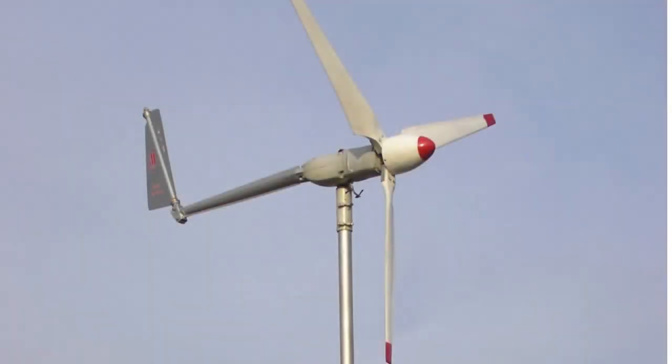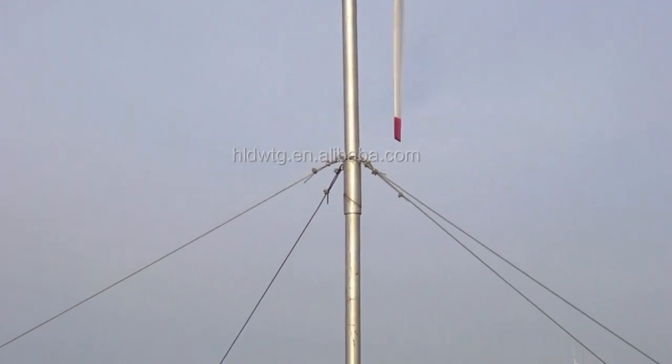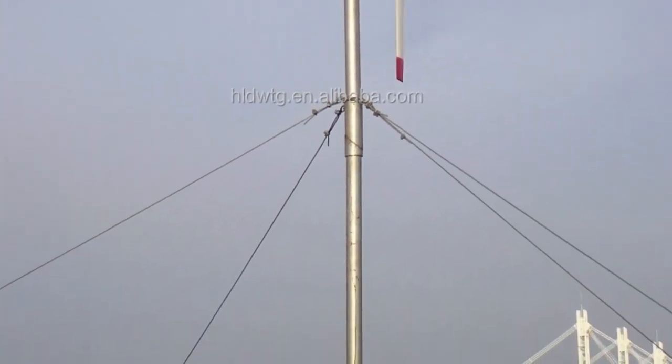The other thing to be careful of is your installation. The wind turbines are usually installed on a pole. It's advisable to secure your pole with guy wire attachment plates. That's stiff wiring, and they're placed on all 4 opposite sides of the pole. This will give you a sturdy mount and also protect the unit in heavier winds.